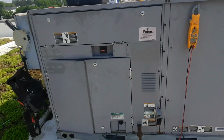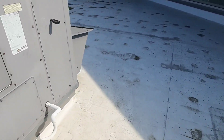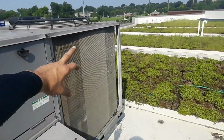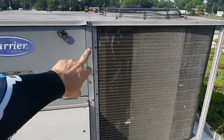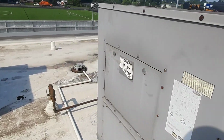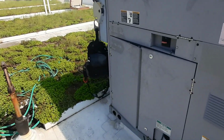My issue at this point, and my theory would be, when I found this guy the first time, the condenser coil was completely plugged, and I'll bet we've got restrictions in the orifice that has made it into the dryer as well. So now everything's kind of restricted.